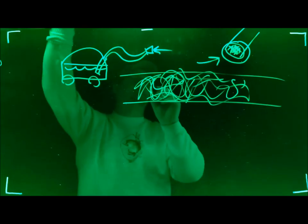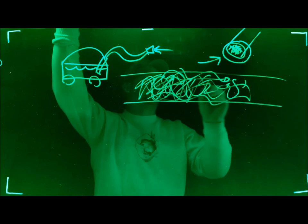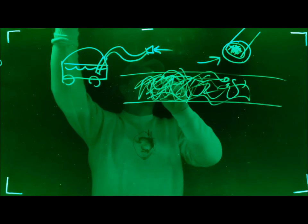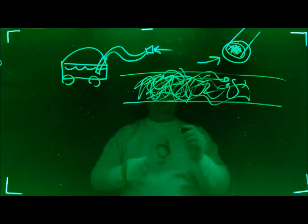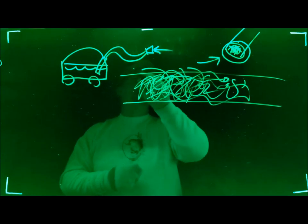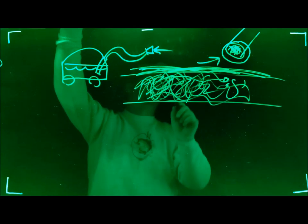And that's what we saw with the miner's moss, that we were getting clogged up with all our little hematite and black sands, and then we were turning into this slick plate of black material, and we had to clean our box a lot. What was happening was that it wasn't actively exchanging, so we weren't getting these nice vortices in here. What we were getting on top here was this big buildup of material.